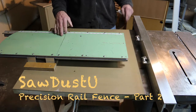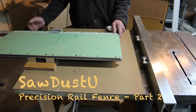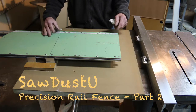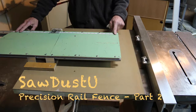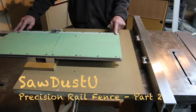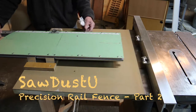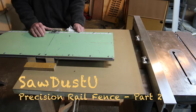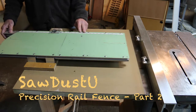The other key to the system is holding the fence parallel, and that's where these rails come in. I'm going to install a little cursor here on my Lexan cover over my Starrett self-adhesive scale. You can see how easily that slides — these are quite heavy but I can easily move that back and forth with one finger. I can get that within a hundredth of an inch. It's a real, real nice accurate system.